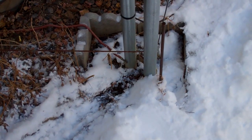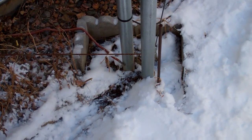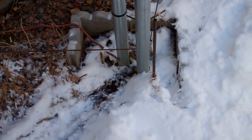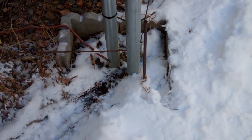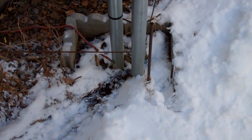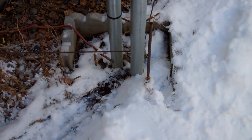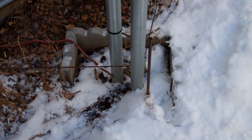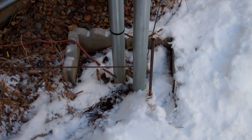The pit for the base was approximately 2 feet around and 3 feet deep. Before pouring the concrete I put several pieces of 4-foot rebar, which I pounded into the ground around it, and had them contact the base of the mast. Then I poured in 9 or 10 bags of concrete cement. In addition, I added a standard half-inch copper-coated grounding rod, which extends about 6 feet into the ground.